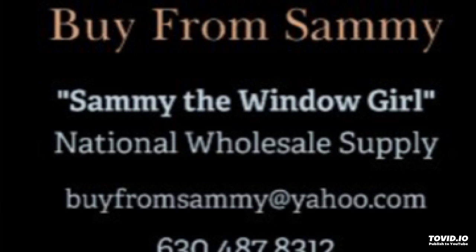So the two different types of mullion kits: one is called an H-mull, and that would also be used as a field mull. An H-mull is basically just what it says — it's a vinyl piece, or it could be made out of other materials. It is a piece of extrusion in the building industry that is in the shape of an H, fitting in between one window and another in order to screw or fasten them together to make a double, twin, or triple unit combination.